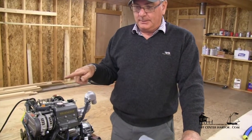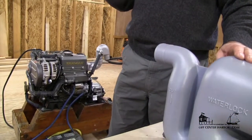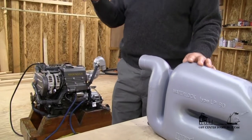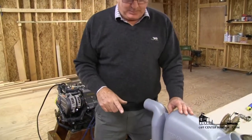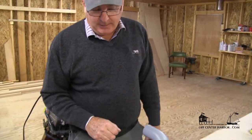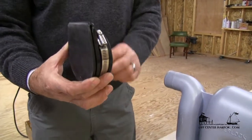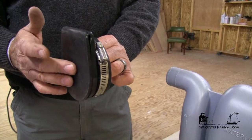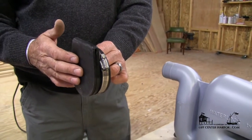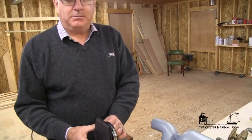At the highest point of that U-shape will be an anti-siphon valve so that the boat can't flood should the stern go below the exhaust pipe. We then come to the exhaust through-hull fitting, which is fitted into the boat with no valve — just a through-hull fitting. The rubber hose hooks onto the inside, and on the outside there will be a flapper valve. The flapper valve will prevent any wave action or water from entering the system going the wrong way, which could, in some instances, flood the engine — not a good scenario.